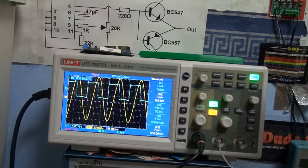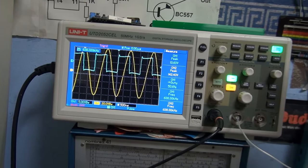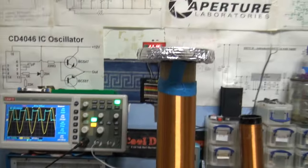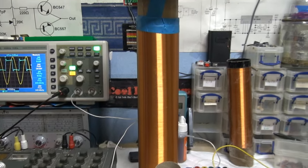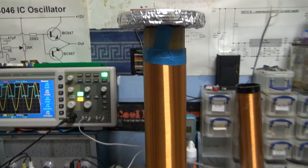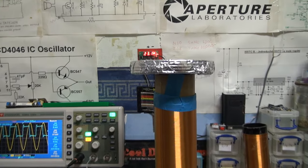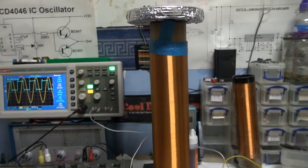So, anyway, we can say that the resonant frequency of this is about 638 kilohertz, roundabout. And yeah, I'm quite happy with how this coil turned out. So in the next video, this is going to be connected up to a proper Tesla coil circuit, and we'll see how well it performs. But that's it for now, so until next time, goodbye.